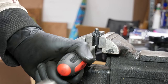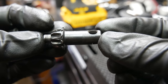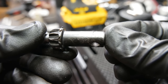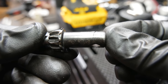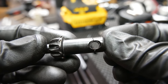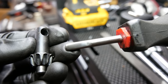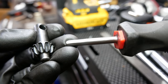It seemed like it was working really well until it snapped the head of the key. The steel here sure is hard, but that also makes it brittle — so when you try to wedge something into it like that, this was kind of inevitable. As mentioned earlier, the material around the hole of this chuck key was a little bit thinner than on the last one we used. So we're going to scrap the other plans and just weld the screwdriver in. I went ahead and ground in two flats for a little bit of a thumb rest before we permanently attach everything together.